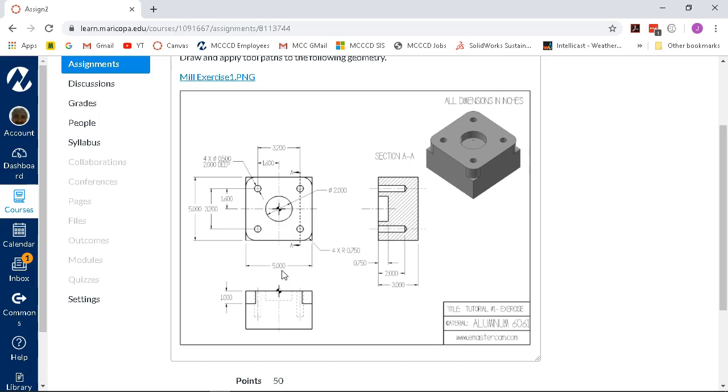I'm not just going to be able to blow this around. If it's steel, can probably count on it being 5 to 10 thousandths undersize, right? So at that point, I may still be within my tolerance zone, but I have to adjust to what the stock sizes are going to be. All right, so I think when I ran this previous, we kind of just looked at it as, oh, we could square this up offline, but I'm not really getting very efficient with the geometry.